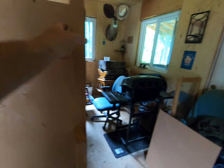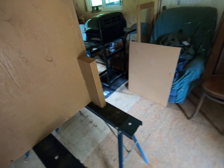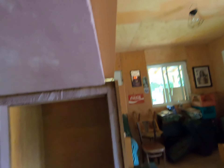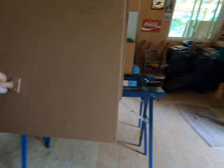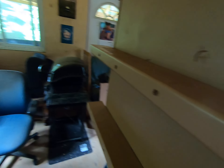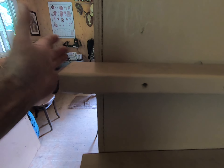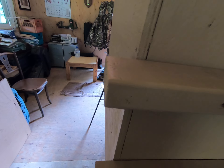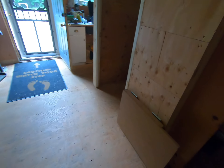I got it on its side because I've been staining it — there's two coats of stain all the way around. There's a piece of plywood that goes on here as a roof to keep the water off, and then I've got steel to go on top of that for the roof. It's on its side because I had to do the bottom. It's all done with plywood inside, then two-inch solid foam insulation, and we've got our hinges, latch, and handle on it. These are the runners on the bottom that are going to sit on the concrete blocks outside, sticking out two inches from the back to space it two inches from the wall.